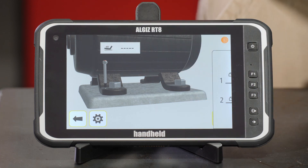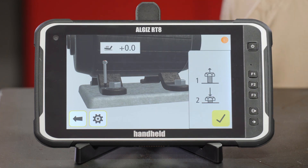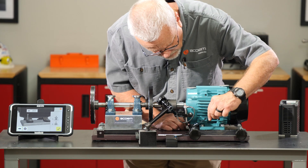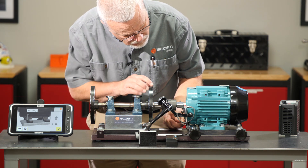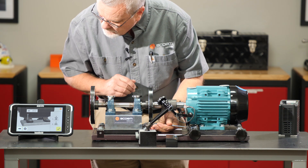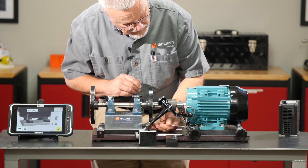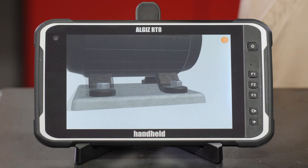I just touch the icon here to tell it to begin the measurement. It's going to take just a moment for it to zero out. Step one is to loosen the bolt, step two is to tighten, and then we'll hit the check button. So I'll reach around here and loosen this just enough to unload it, give it about a three-second count, tighten it back down, and hit the check.